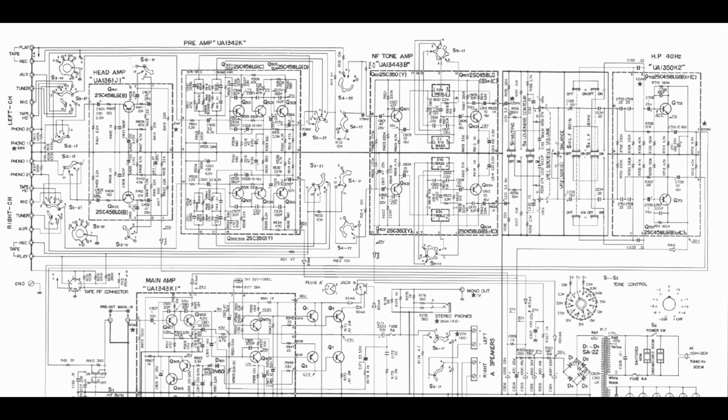The next thing I decided to look at was this HP 40 Hertz board, and it's fairly easy to get at, although I did have to unsolder one wire from it to get it bent over to where I could look at it. I replaced all of the electrolytic capacitors on it, of which there are 6, testing them as I went, and they all tested fine. Turned it on and still had the problem.